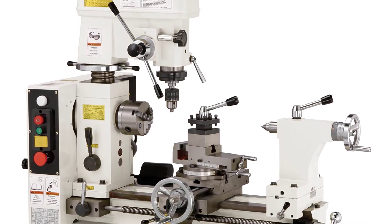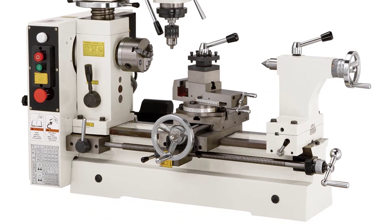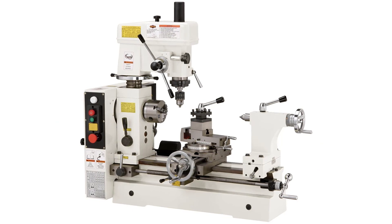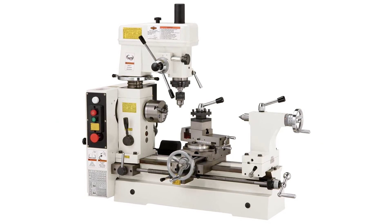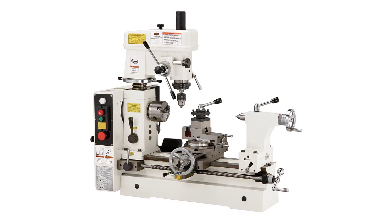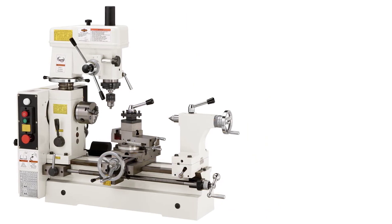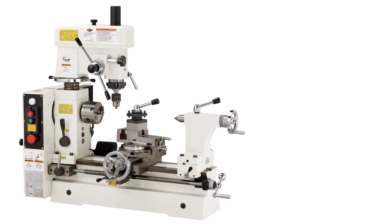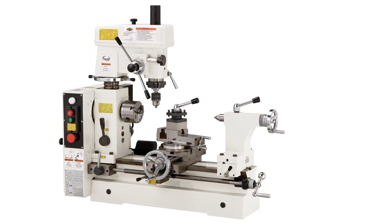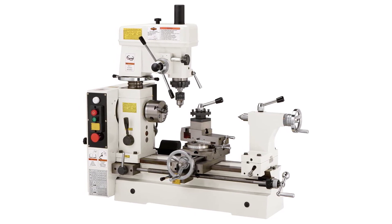In terms of add-ons, it comes with a four-way turret tool post, a 9½-inch faceplate, a 4-inch three-jaw chuck, and a built-in rotating vise. It also has an 11½-inch swing over the saddle, along with a 19 and 3/16-inch distance between centers and Morse No. 3 tapers. At 501 pounds, this is one of the heaviest lathe mill machines you can find on the market. The turret tool and its functions make your life easier when using this machine. It has manual carriage controls, and its longitudinal hand crank allows you to maneuver the carriage in the same direction as the lead screw. This helps you zero in on the cutting tool and keep track of both the location and movement of the tool you are using.